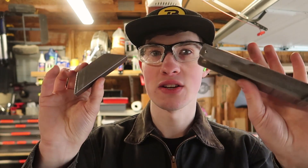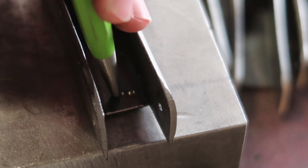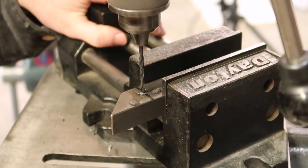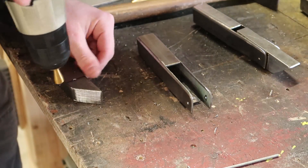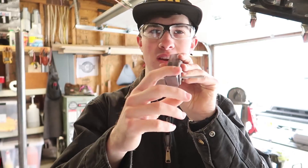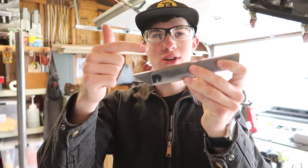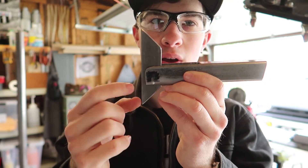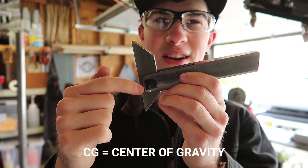Now that we're right back, each finger is exactly in the same location. I'm going to punch a number of dots on each finger to assign it to an arm. I've got a pin in here for mock-up and it's working perfectly, except I'd like it to return. I think what I'm going to do is move this hole up a little bit, which should make this finger tilt back a little more and move the CG to the inboard side of this pivot.